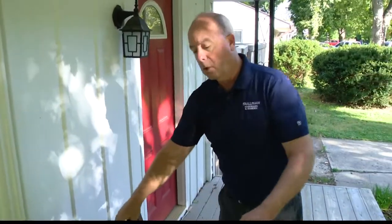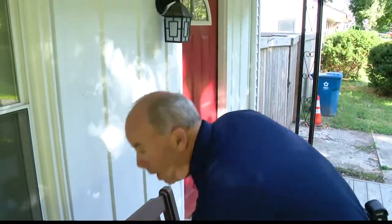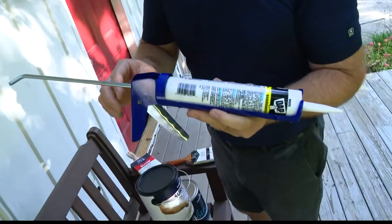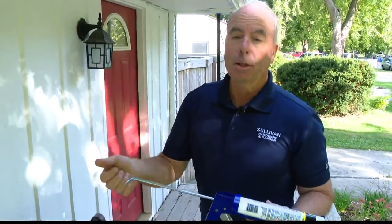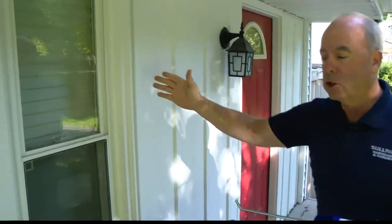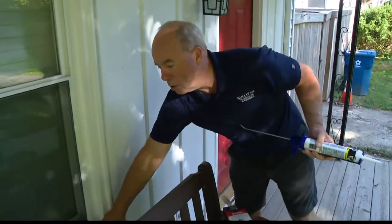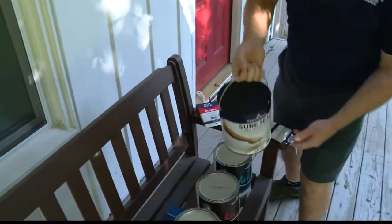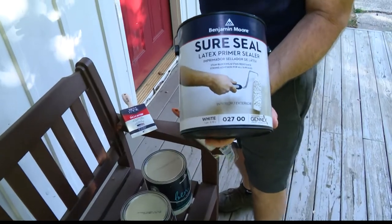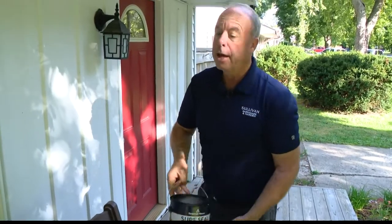Once you get that color picked, make sure you do the prep — it's so important. Do cleaning; there are all kinds of cleaners, and this stuff called 30 Seconds Cleaner is really good even as a maintenance product. It's also a great time to caulk. Number one in an energy efficiency audit is generally not insulation, not windows, not doors — it's caulking, because it's so cost efficient. Make sure you're sealing around frames to stop air infiltration. If you have spots with chipped paint, like on sills, make sure you use a good primer. Do the prep work: scraping, sanding, and using a good primer on problem areas — then you're ready to start painting.